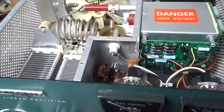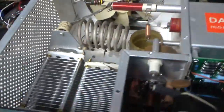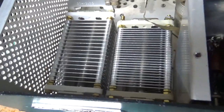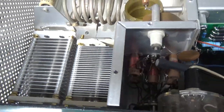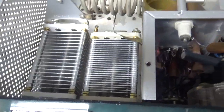Okay, so we're back with the completed amplifier. I almost forgot to take a final video. I replaced the plate tune cap — the air variable capacitor — and ended up replacing the load side too. That's some damage. Retested it on all bands, no more intermittent arcing. She's good to go.